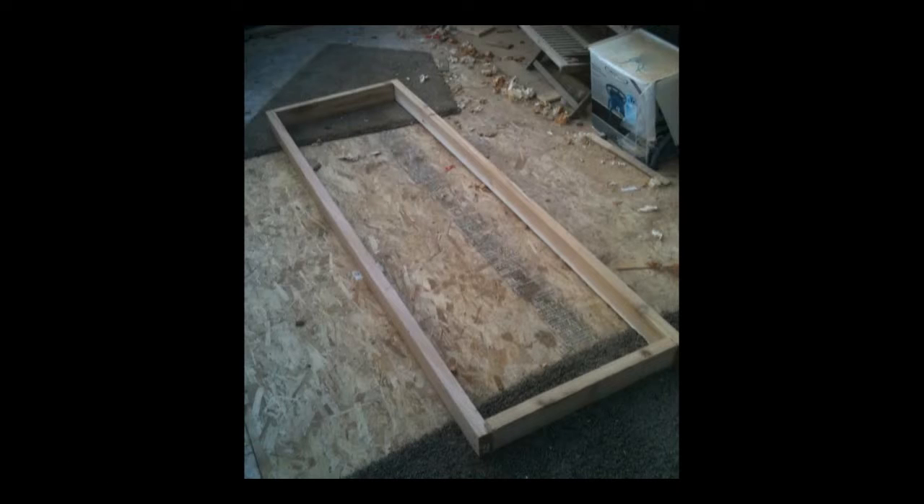Once the drawings were done it was time to start building, so I built the first frame — basically the bottom of the couch. This was glued and screwed together, and as you can see it's made out of 2x4s — rough cedar 2x4s that I just took off the rack at Home Depot. These look pretty smooth and were smoothed out with a hand plane on that table, planing it down until nice and smooth. When you buy these, the edges are quite rough — you can see this one even has some staples in it.